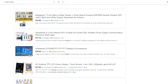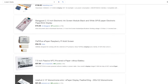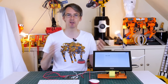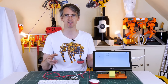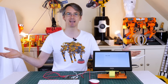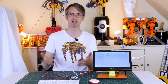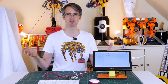So then I looked for ePaper displays, and ePaper displays are a rather recent piece of technology. They use them in Kindle eReaders, and basically there's no backlight, and it only uses power when it updates. It's got a very low refresh rate of about 2Hz, so you can't really watch movies on it. But it doesn't use any power unless it updates, and basically you can power it down and walk away, unplug it from a computer, and the message still stays displayed there for several days or weeks.